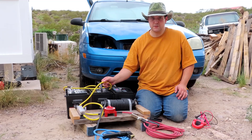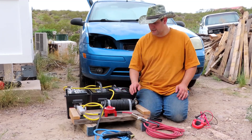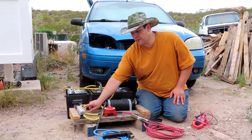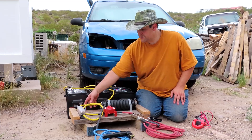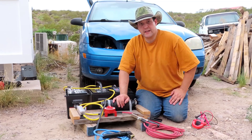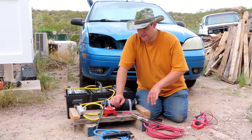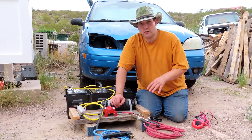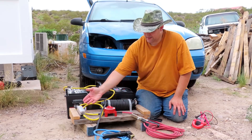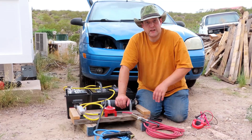Here is the positive and here is the negative — the black wire is the negative. The positive goes over here into a fuse; this is a 400-amp fuse. I have a video where I was hooking this thing up and talking about it, and also a video showing how these cables are made — link will be up here. Then it goes into a battery switch that can handle up to 600-something amps for a short period, like 400 continuous. Perfect for this welding — the fuse will blow if we get too far up in the amperage range and shut everything down for safety.